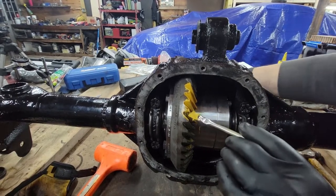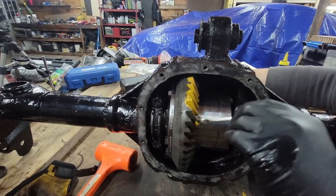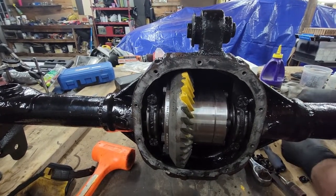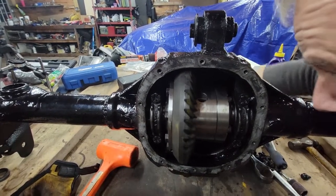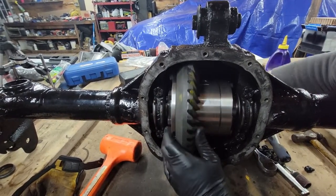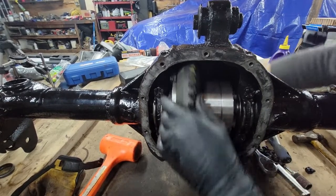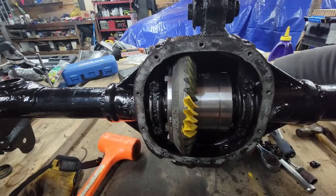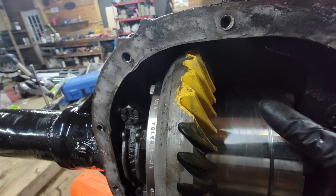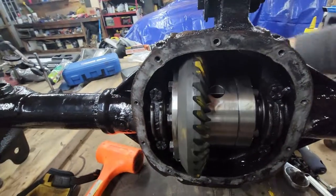You want to paint at least three to four teeth so you can see what happens. Now we're going to roll this over into our gear and make sure that we have a good back and forth. Now let's take a look. We're right where we belong on both sides.